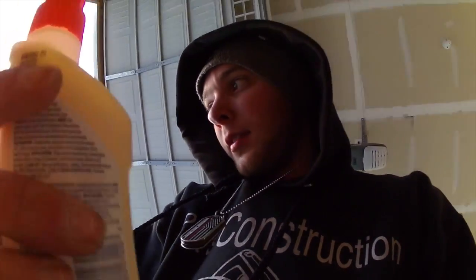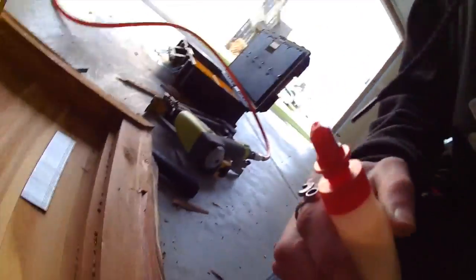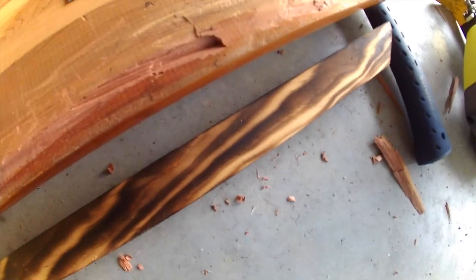So with that said, I gotta brad nail it, then I gotta wood fill that one little slot in it. So, I'll catch you guys in a minute or two. Alright. So, I'm gonna put this on a little bit of wood glue. And 5/8 brads. Possibly 1 1/4 brads, depending on how I want it to break through or not. So, that's my debate. But I'm gonna glue this, a little bit of glue, because there was glue on here.